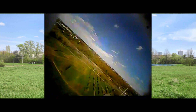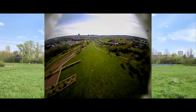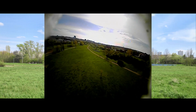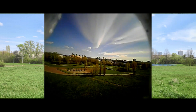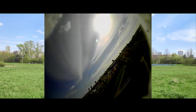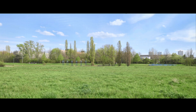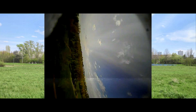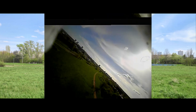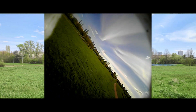Later in that flight I also did a stall test. The video quality was so bad I'll just narrate it: the plane tries to drop the nose — the CG was on spot — and just dips the nose. I pushed hard back to keep it level and it was kind of controllable for a while, but then suddenly it rolled over one full spin until I was able to recover it. As long as you don't force a really strong stall, I see no problem.